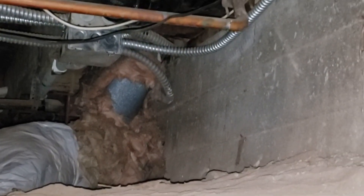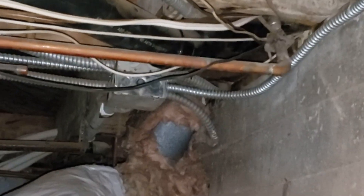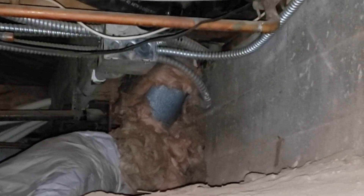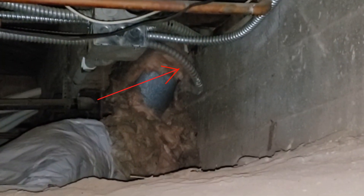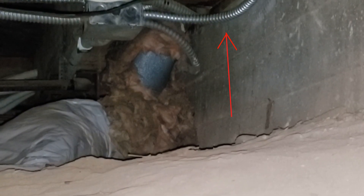The original box only had one-inch and three-quarter inch cutouts or knockouts, and being so close to the wall it was really hard to get at the knockouts anyway. So we added an extension with half-inch knockouts for the flex that we cut, and then the new one that we extended back to the outside outlet.